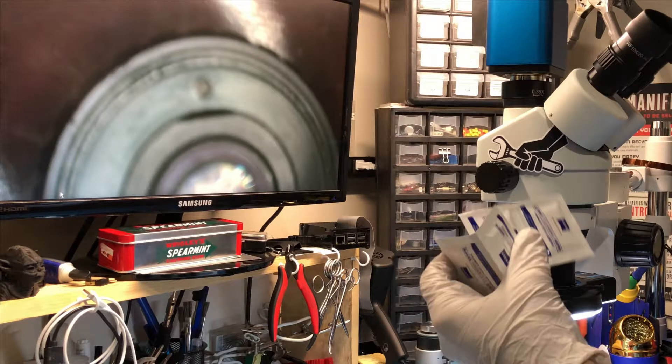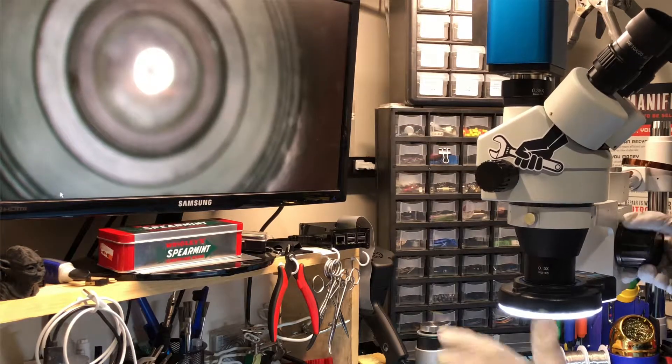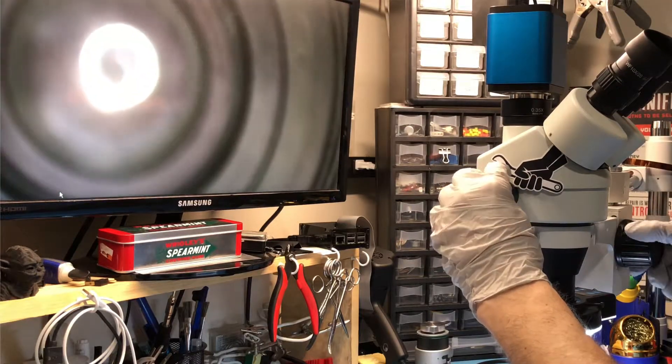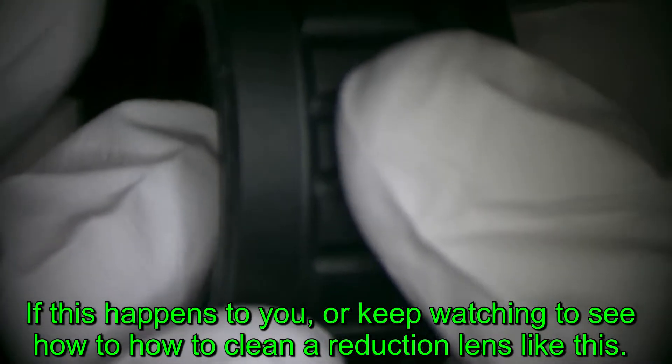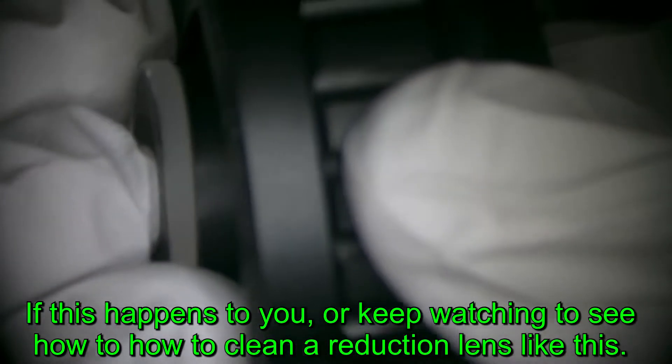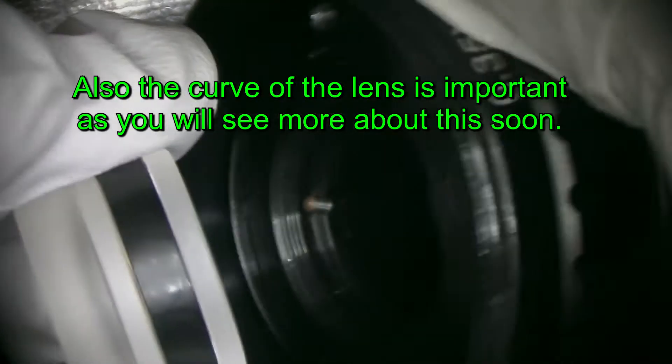Now we're going to clean these lenses. After flipping them back and forth upside down, we've got some dirty lenses. First off, remove the old lens — I already took off the retainer ring, which is a little ring with two small slits. Be very careful taking that off so you don't damage the lens. You can see the big lens was at the bottom facing the microscope — that was backwards. It should be small lens first, then spacer, then big lens.